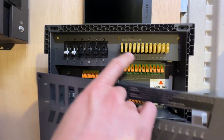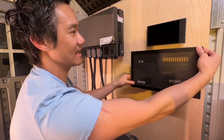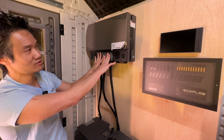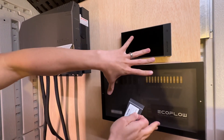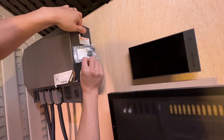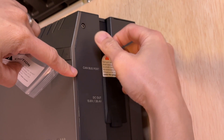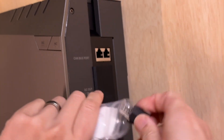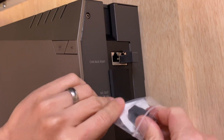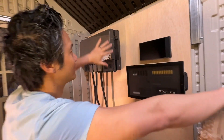You'll have six AC circuits and 12 DC circuits with circuit breakers, fuse, and everything. But we're going to keep it closed out for now because we're not wiring it yet today, and we're not going to use the console either. Now, it's very important that because we're not using the console and not using the AC distribution panel right now, we plug the two communication ports with these included plugs. Otherwise we'll have some malfunction. So these are the CAN bus ports right here — we got two of them. We're going to use the included plugs to terminate the communication so the system will be stabilized.